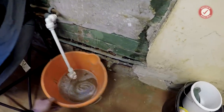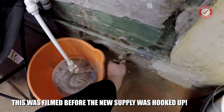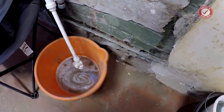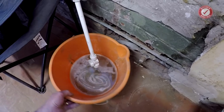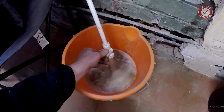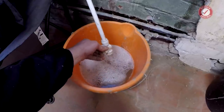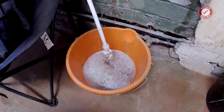I've already switched off the water supply. This is still connected to our old lead supply, but hopefully Northumbria Water will be coming to connect up the new MDP supply. We're still fed through the lead supply at the minute, so that is off. I'm also going to depressurize it as well. I've got a bucket here - that's just what's in the pipes basically. I'll leave that tap open and any water that's in the pipes will hopefully just drain into that bucket.